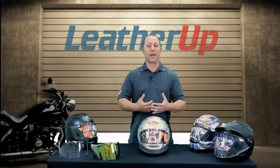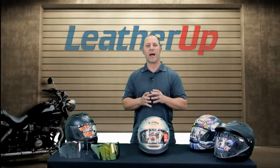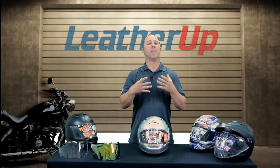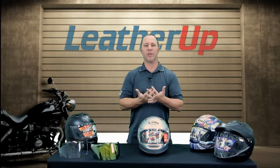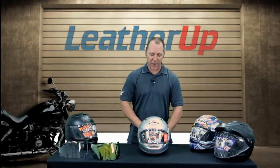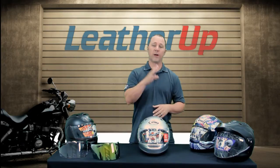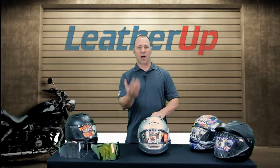So you're getting the highest-level quality helmet out there. Let me tell you a little bit about how this helmet is actually made. They actually chop the fiberglass into random pieces and blow them into a machine that creates a random matrix — basically a nest at the bottom, much like a bird's nest. All these pieces of fiberglass intertwine with each other, creating a very strong outer shell. There are two ways to manufacture a helmet: a soft outer shell like polycarbonate or ABS with a hard inner liner, or a very hard rigid outer shell with a softer inner liner.